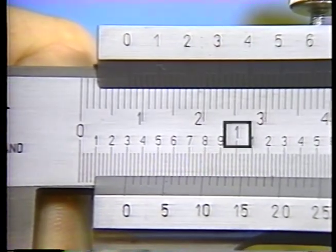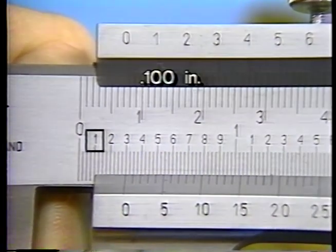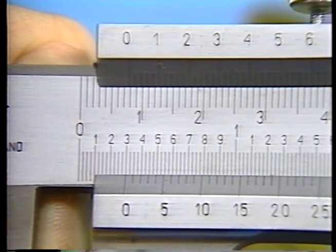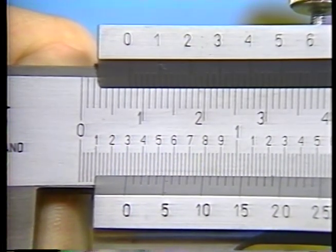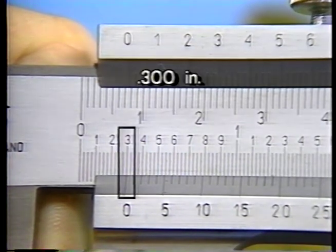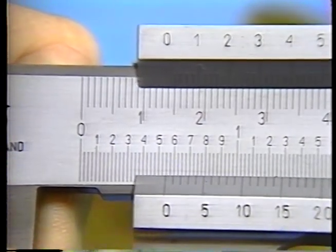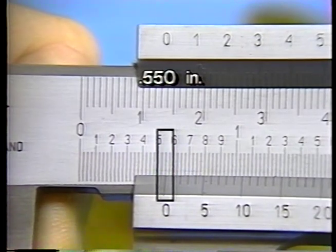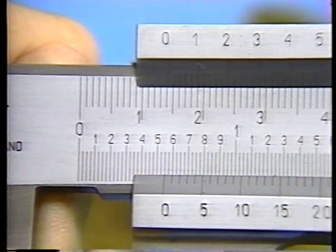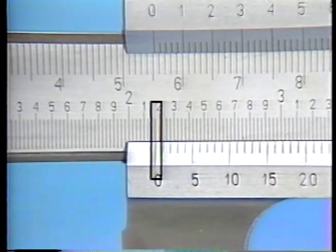The longer lines and larger numbers indicate inches. The line indicated as one represents one-hundred-thousandths; the line indicated as two represents two-hundred-thousandths, until we get to one inch, two inches, three inches, and so on. This point on the main scale is three-hundred-thousandths. Here the reference line is two short graduations beyond five-hundred-thousandths, which indicates five-hundred-and-fifty-thousandths. Remember, each smaller line equals twenty-five-thousandths, so two lines beyond the number means an additional fifty-thousandths. This point on the scale indicates two inches and one-hundred-seventy-five-thousandths.